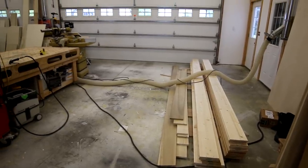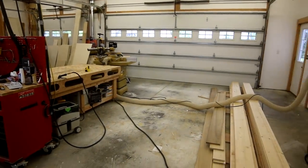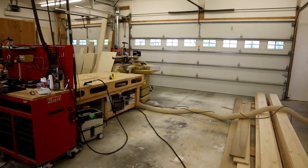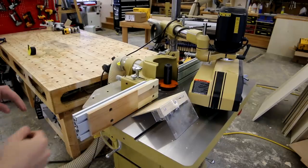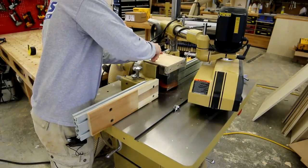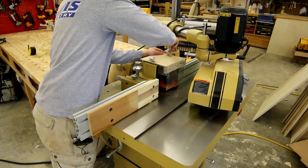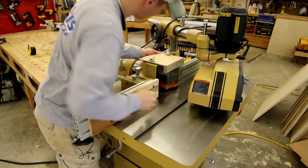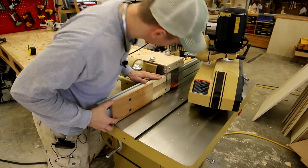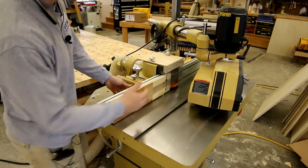Here's all the material I'll be running through to make these barn beams, and that's where I move my shaper to. The built-in casters on the Powermatic shaper are absolutely awesome — with a small 36-foot-wide shop I need to move it to get a really long lane for these long boards. I've got my bit chucked up with a custom-made shield to help reduce debris. I've also put a wood auxiliary fence on, which is important because it catches the milled tongue side as each board passes through.